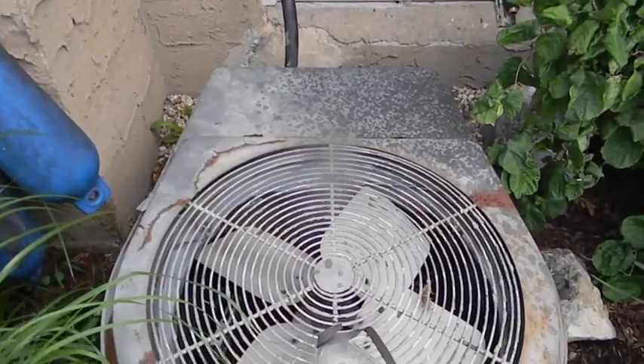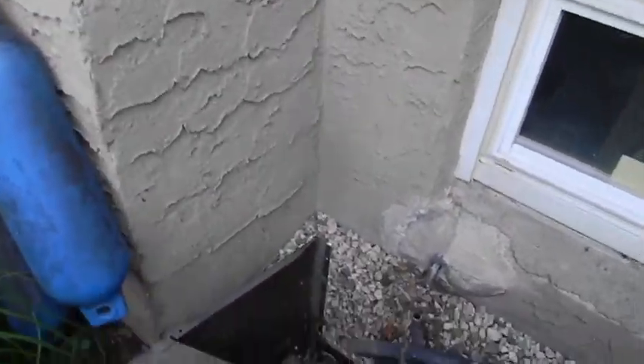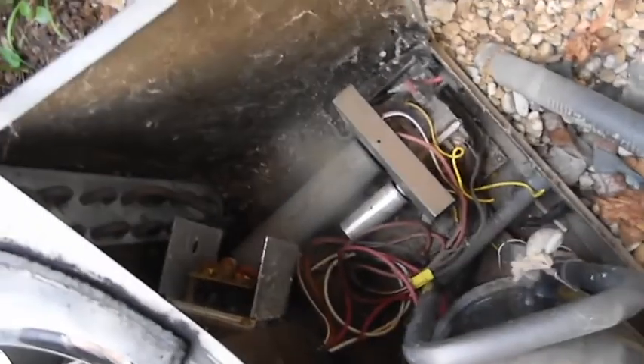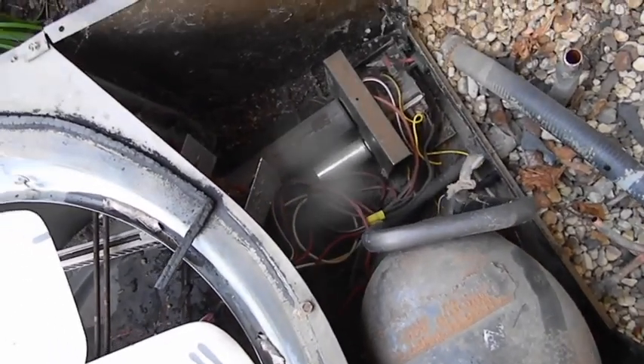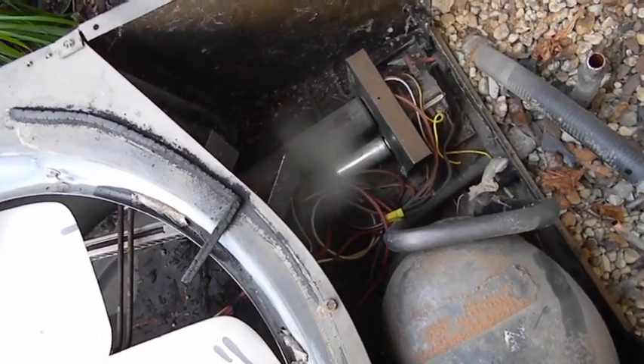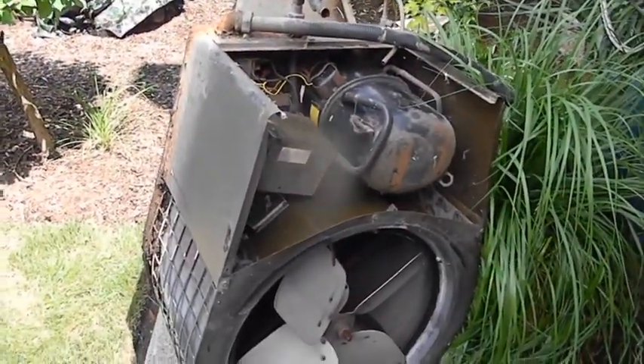Pass stuff through the window, whatever it takes, get this thing out. After you have an electrician come in and disconnect the main wires, disconnect the controller wire from the thermostat, have the system evacuated — this system has nothing in it — and cut the lines, that's pretty much it. After your electrician discharges those two capacitors that could launch you across the lawn, you get to rip this thing out. She's out — there's the base.